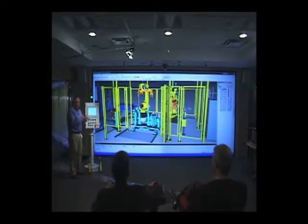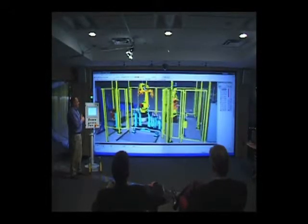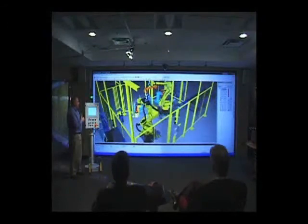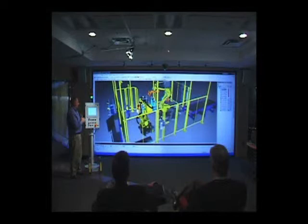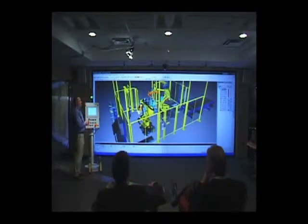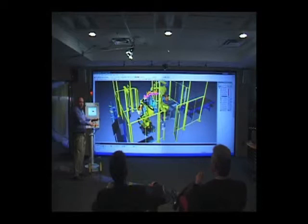For this scenario, we're going to use a virtual safety device to trigger the fault condition. On the far side of this particular cell, we have a safety gate. We'll start the load just as we did before and load it virtually. I'll start the cycle, and once we get into the major move, we'll open the safety gate during the cycle, therefore triggering an unsafe condition — the virtual device triggering the emergency stop.